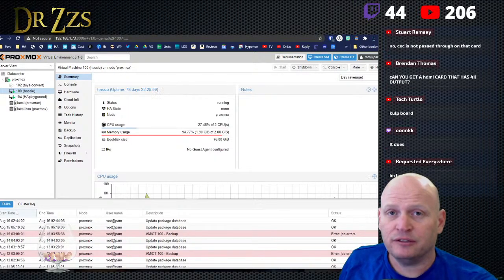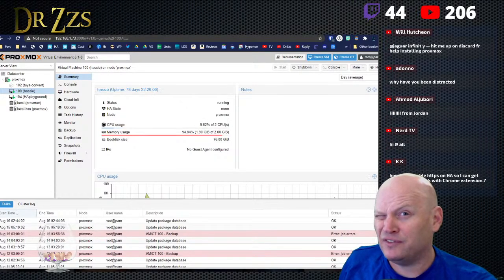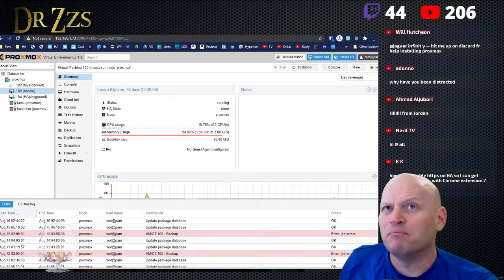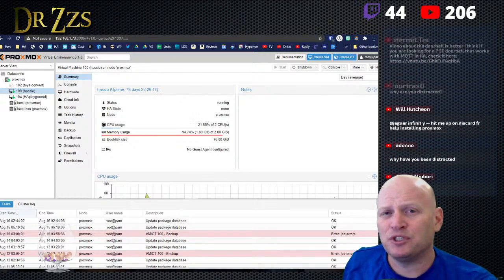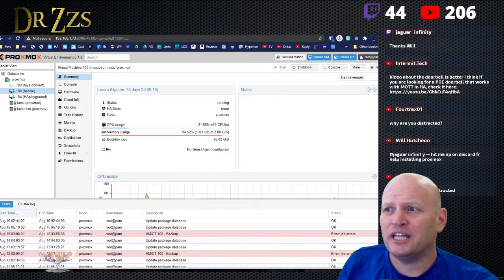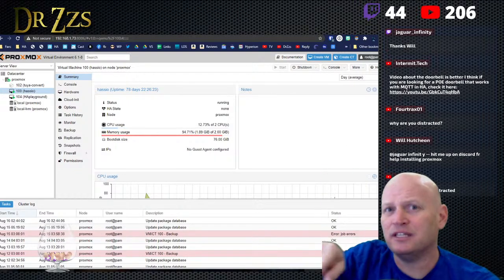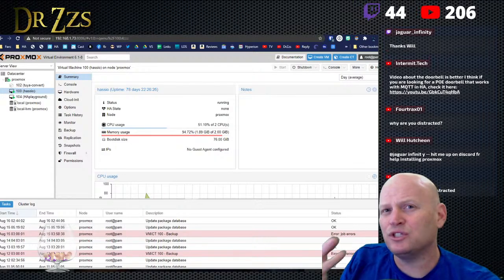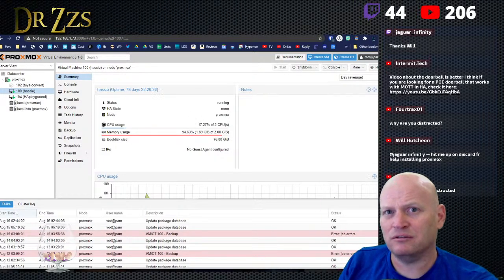Yes, you can, Brendan. You can get them that have 4K output, but they are a lot more expensive, like $50, $60. But I don't think you want that, because when you input it into the Pi, which is what you're doing with the capture part of it, it's dumbing it down anyways and just sending some color numbers to your LEDs to match the screen. So you're not really using that 4K signal. You're taking that 4K signal and you're just dumbing it down and sending this simple color data.